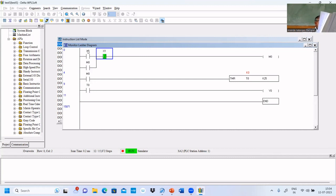After that, turn on the auxiliary motor after a further delay. Further delay means a total of 15 seconds delay — that is, after a further delay of 5 seconds, making it totally 15 seconds delay. Then turn on the auxiliary motor.